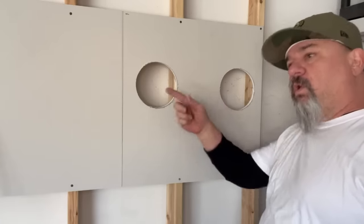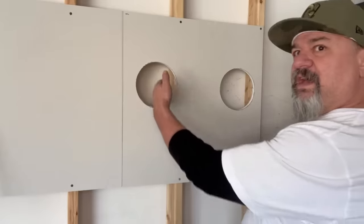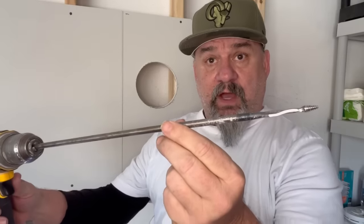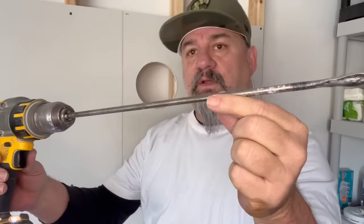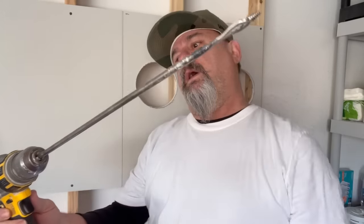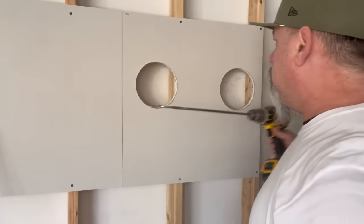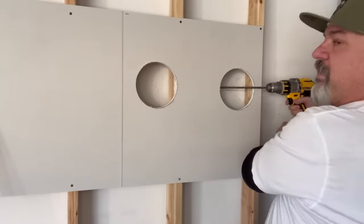Since I have two holes drilled out, I can tell there are no wires — I'm right on the other side of the other stud and I know there's no wires there, so I can go ahead and drill it out, and so forth. Now I've got my long drill bit — three-quarter inch, about 18 to 20 inches long — just so I don't have to fight with the Romex pulling it through. I stick it right in that hole and I know there's no wires.